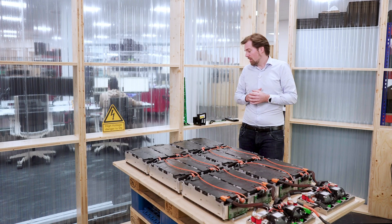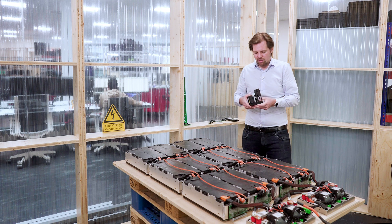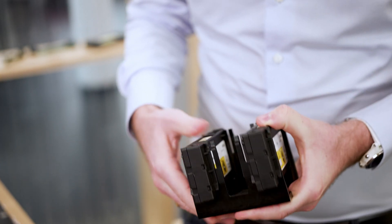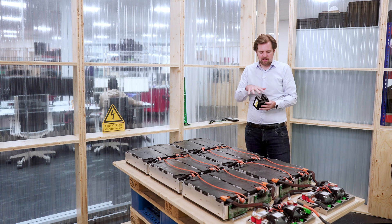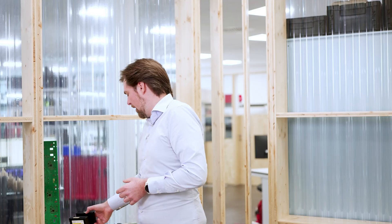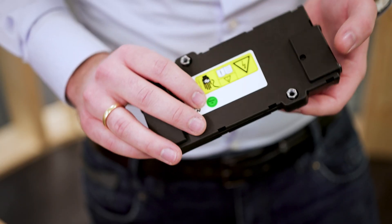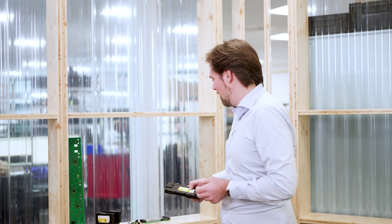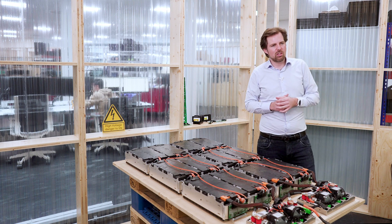On the other hand, large electronics cost money and take up space, so there's also interest in making cell monitoring boards very small. This is an innovative concept where we have three 33-channel cell monitoring boards that are very compact, which we can clip into a holder, saving a lot of space. Those parts measure as many voltage channels as each and every cell monitoring board here combined. There are also different housing methods — this housing, for example, has an integrated nut which makes the mounting process easy. There are many little details which can be done to make CMBs optimal for the end application and which make them cost-efficient and easy to mount.